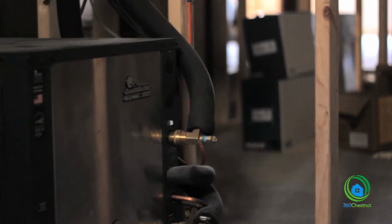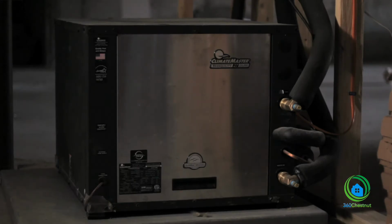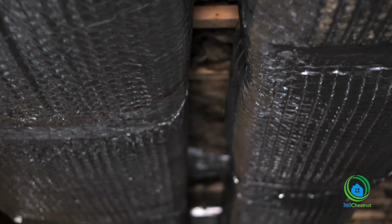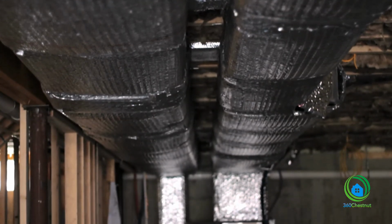We're extracting energy from groundwater, or water that we're circulating through the ground, which in turn picks up heat or temperature energy from the ground and brings it back to the heat pump unit inside the home. The unit then extracts the energy out of that water and transfers it into the home. The water is coming into this heat pump, and the pump is literally extracting heat energy out of the water. The ductwork is the same as any central air system, whether it be ductwork, water-to-water radiant heat, or baseboard. The geothermal can provide energy to those outlets, if you will.